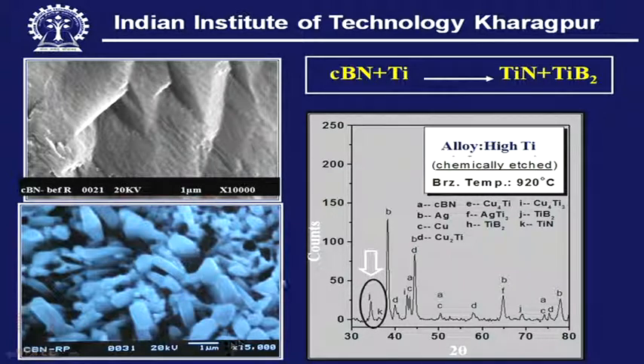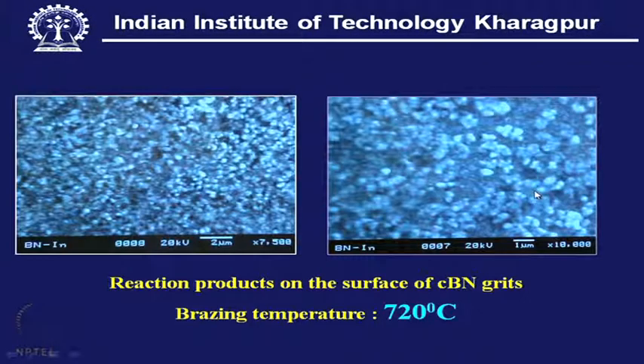The existence or presence of titanium is so useful and effective — also to have wettability over steel. At 920°C with almost 10% titanium, we see a very strong reaction showing needle-like titanium diboride. Whereas at 720°C, we have a mild reaction with very low thickness — good enough to have good wetting while also having an adequate bond guaranteed by the thinness of the reaction layer.